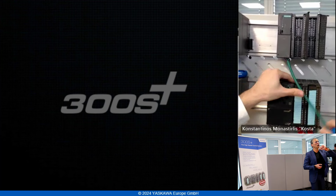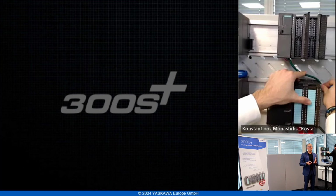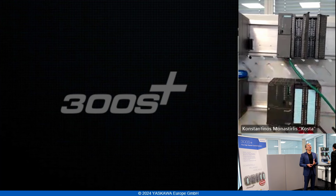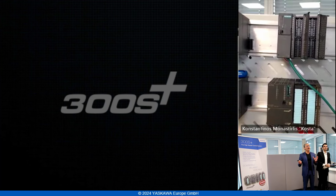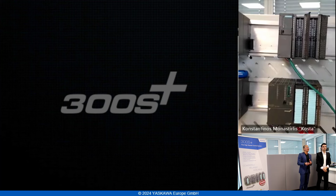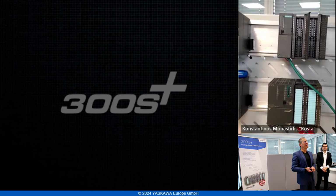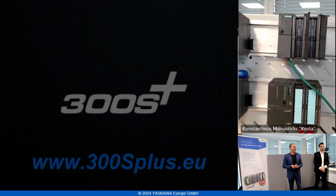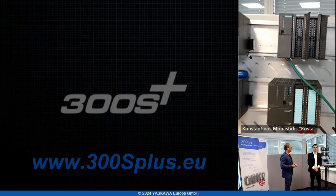It's similar to what you see now at the bottom, because we are just transferring the same project. That's why we want to have the same hardware configuration. We selected a corresponding CPU and the corresponding IOs. By the way, we can provide you a cross-reference list where you can find all this data. In this cross-reference list, you will find which are the Siemens CPUs, which option we offer at Yaskawa, and which are the IO modules, and which option we offer at Yaskawa.